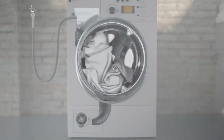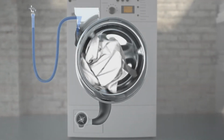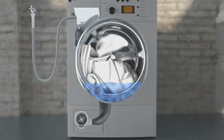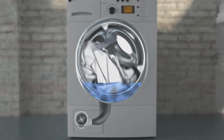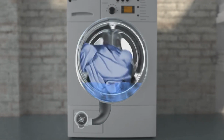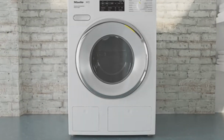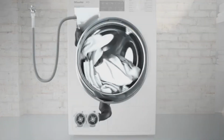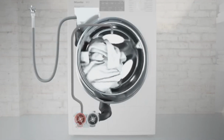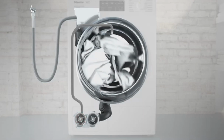You should also remember that modern washing machines will work intermittently if the water pressure is insufficient. This is due to the fact that the machine must be filled with water in a certain time. If the required water level is not reached on time, the washing machine may interrupt the program and give an error. The minimum pressure required for normal operation of a washing machine is usually from 0.3 to 0.6 bars.